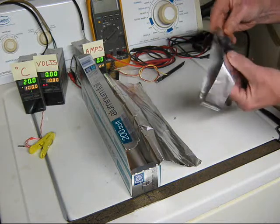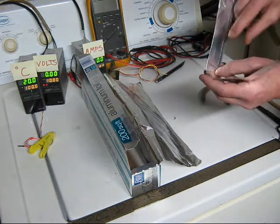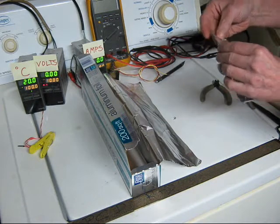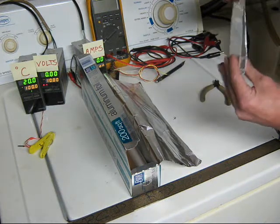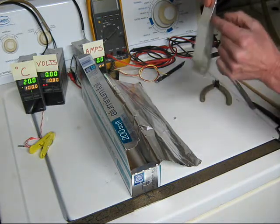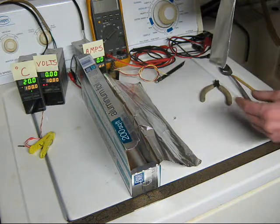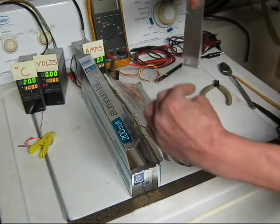But one of the problems with this, because it's a wrap, is that the electrolyte will find its way in between these turns, and gases will evolve in there. And so what happened was that this whole thing blew out like balloons, because the gases that were generated could not escape. So it caused these things to puff out and spread, and they were drawn to one another.